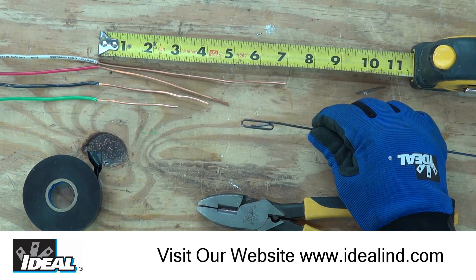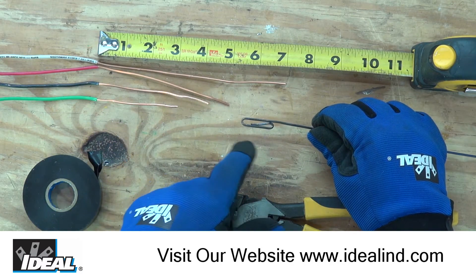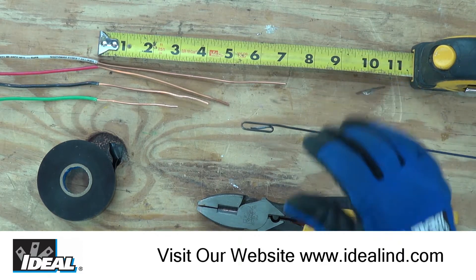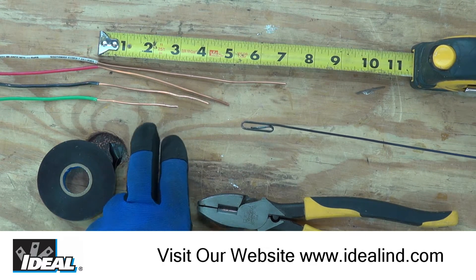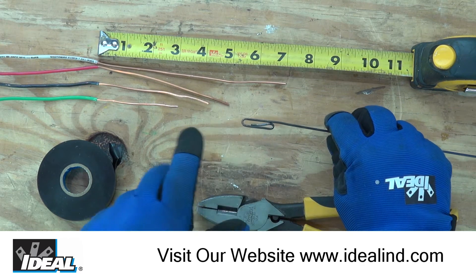There are lots of ways of doing this. If you're just doing a single conductor doing real short pulls, you can probably just loop the wire through the hook here. A little tape, you're probably going to call it good. But if you're looking for a technique for longer conduit runs that will ensure all the wires get pulled through, you'll find a lot of guys recommending this staggered approach to attaching the wires to the fish tape head here.